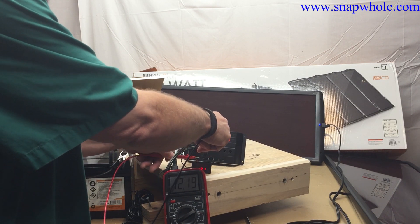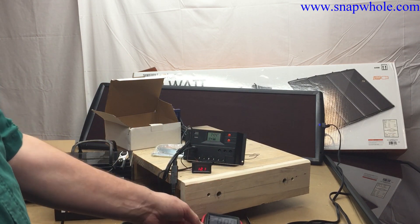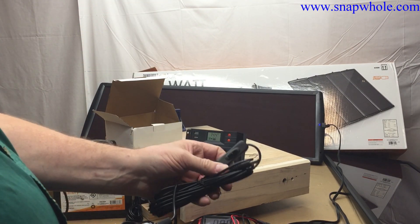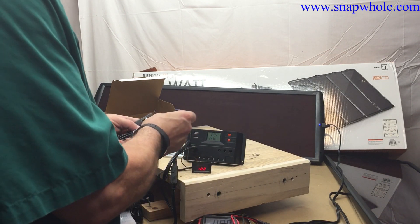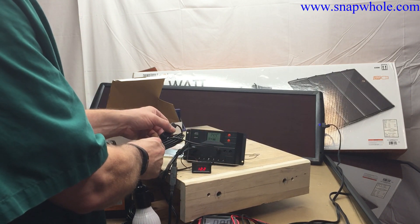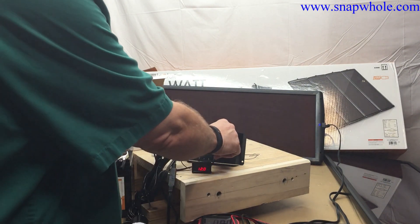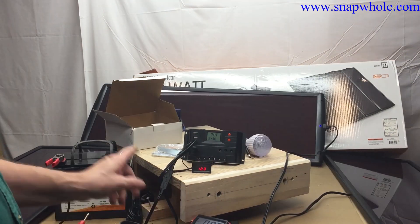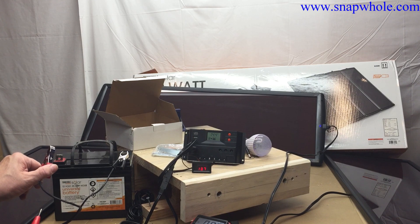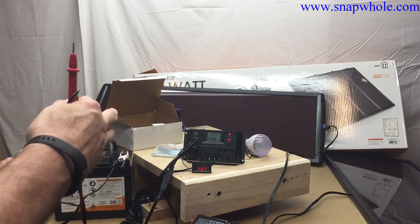That says 12.2 — they're actually pretty close. Can we get a light to work? It has a light with an on/off switch. Let's just plug it in and see what it does — it doesn't change either of the displays and it comes on. So it will power lights. If I unhook the battery, what happens? 13.7 — that's normal. 13.8 is nominal for some things like this.